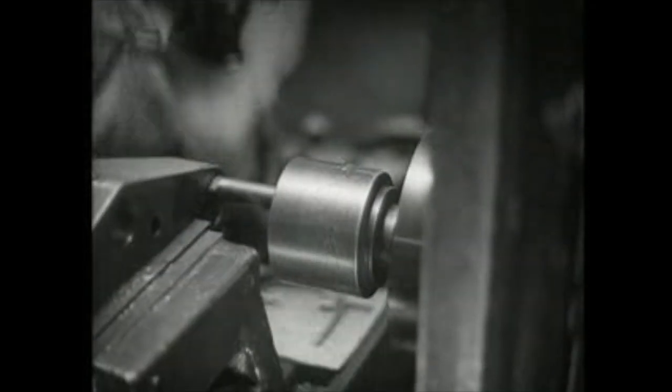I decided that with modern techniques now available, tubes can be produced unseamed — in other words, drawn in one process. The traditional crook is made from a piece of sheet brass cut into a triangle shape, a very long triangle shape, then bent over, and the seam is then brazed. The brazing material is softer than the brass itself — it has to be. Although the process is quite difficult, it does not produce a really satisfactory end result because the brazing material, being softer than the original brass, is liable to be weaker and may crack up over time. This is how crooks have been made for literally hundreds of years.